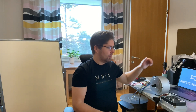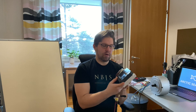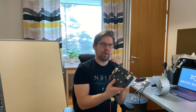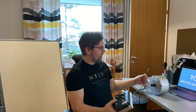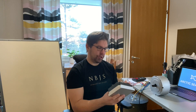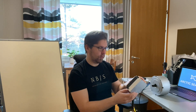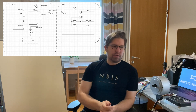I'll go through the system in this video in a little more detail and maybe this will become some kind of video series. This motor system is 48 volts. Most boat systems are 12 volts, and using 48 volts is really good because it reduces the currents a lot — as you can see, these wires are not that thick because of the higher voltage. I'll explain voltage and wire sizing in another video. That's the reason I have to build two systems in the boat. Here's a simple schematic: on the left side we have the 48 volt system.